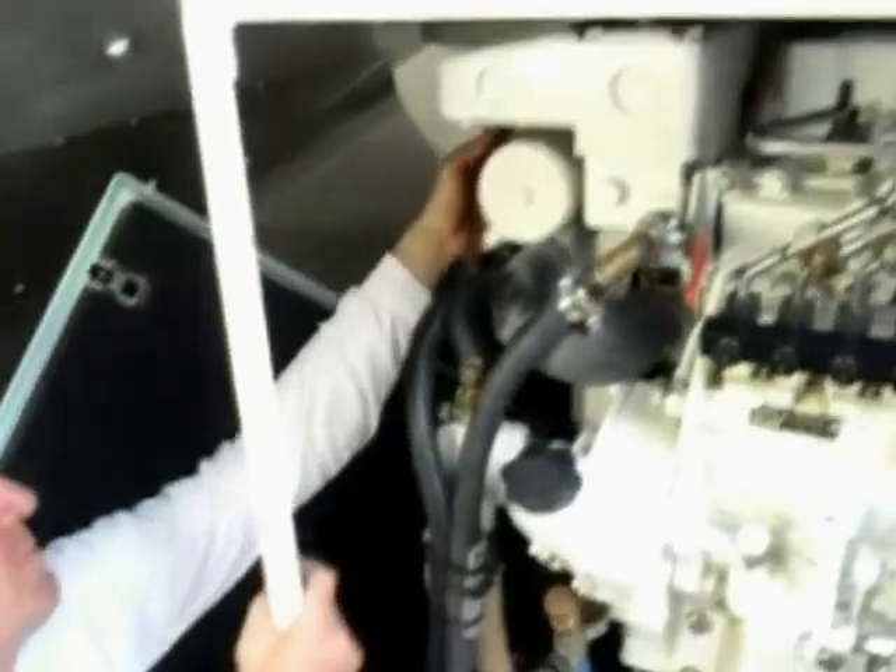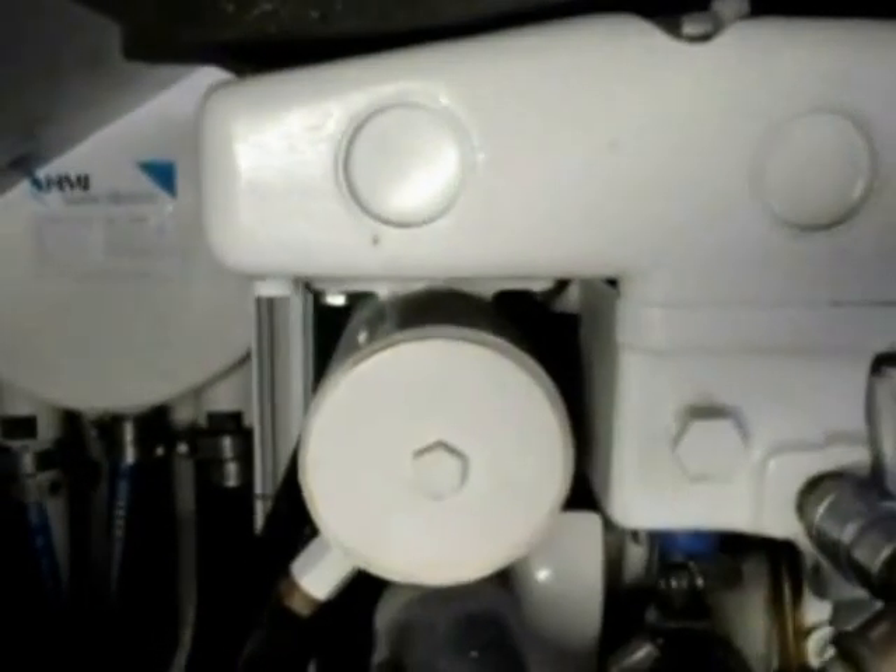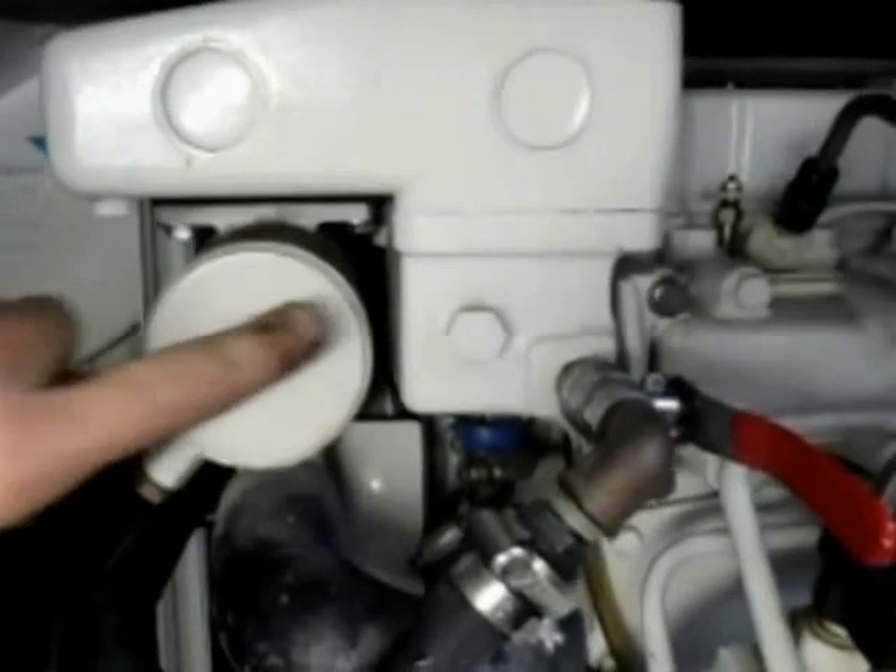I hope that isn't going to drain all of my coolant. It can't, because that's going to be coolant between there and there, and then this is going to be salt water in right here, and then salt water out right here. That tells us this is going to be a double pass, because both the in and the out are on the same side of the heat exchanger. So when we take off this back plate, we'll be able to get into the heat exchanger. Because it's a double pass, this may have a cast line that has to be put back so that the water comes one direction, around and back the other — it may be in the casting. When we pull off this cover, we want to make sure we put it back on in the same configuration.